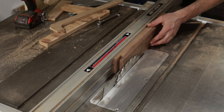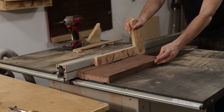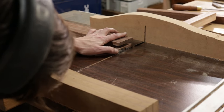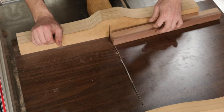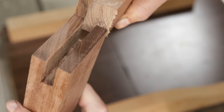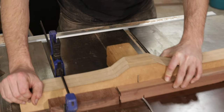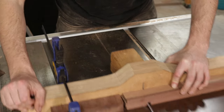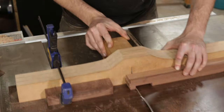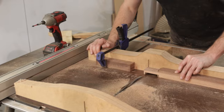After finishing the slot mortise half of the joint, I can cut down some stock for the tenon half — just a square piece of stock. I was aiming to creep up on the correct table saw blade height, but as luck would have it, I got it right on the first try. This process can also be achieved on the tenon sled but I decided to do it this way. It's a bit time-consuming but pretty good for dialing in the perfect fit. It really helps to have a flat top grind blade for this joint — it'll work with an alternate bevel blade but you'll just have to do a bit more clean-up with a chisel.